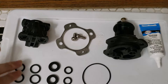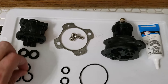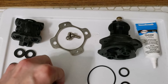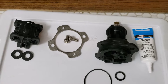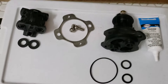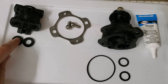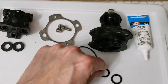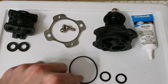After unpacking all the parts that come in the new valve package, we'll organize the ones we know we're going to use. We'll put the two medium-sized o-rings and the large o-ring with the front valve, and the two flat washers with the rear part of the balancing valve. We're not going to use the screws or the round metal plate that came with it because the one we already had is in great shape.